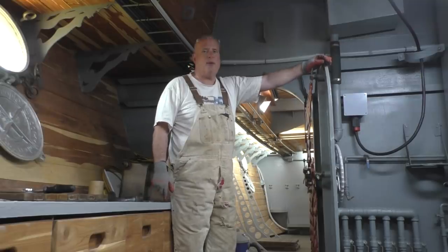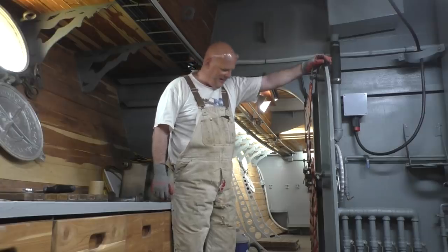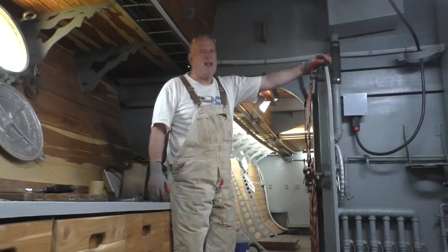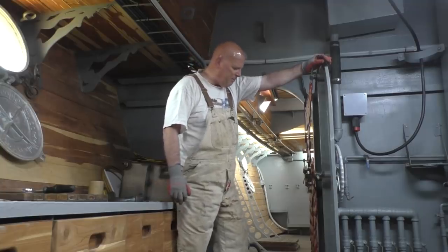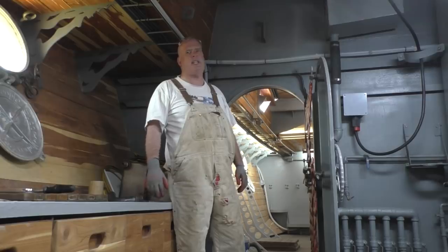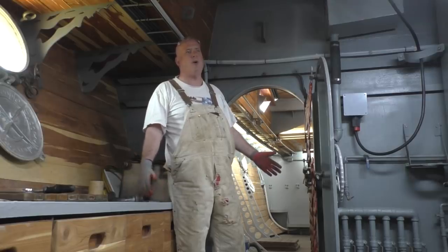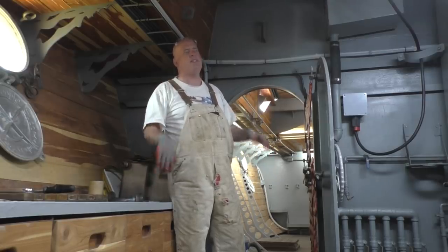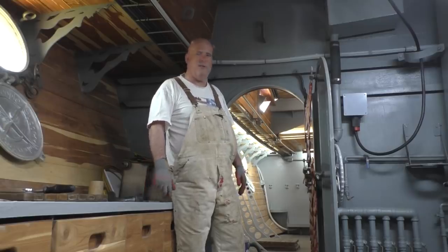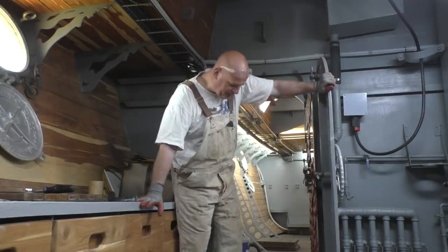And I took my 3,500 PSI pressure washer with that swirl zero nozzle. That thing is so awesome. It sounds like angry hornets. It's slow, but it cuts really good. It blew that lead paint off of everything, dropped to the floor. I had dikes set up in all the rooms to catch all the water, and let all the paint settle. Came back just 2 weeks later and vacuumed it out. Put it in 55-gallon drums back at the house.